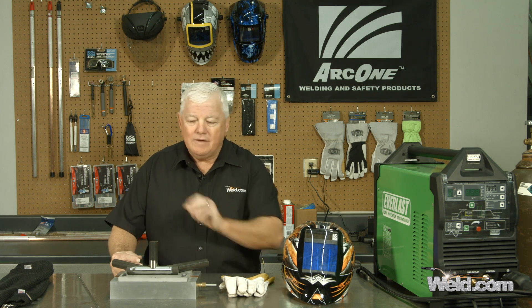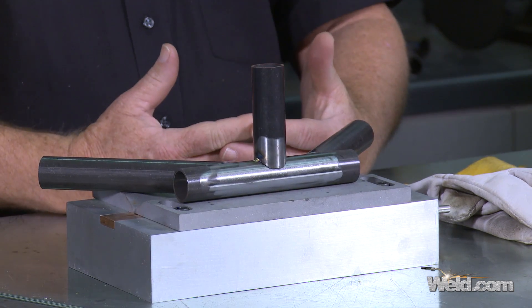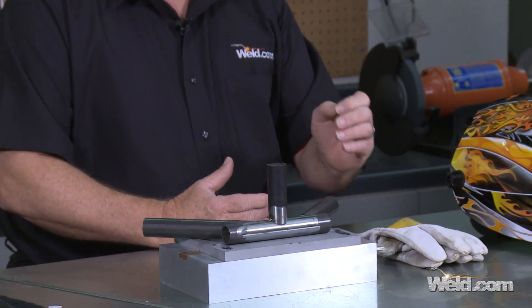So it has found its way into building racing cars, frames, and even aircraft. Let's address it and see what the good points about this filler are and what you need to be concerned about. I do have a sample set up here — this is 4130 chromoly, I have it pre-tacked, and I'm going to use this Super Missile Weld rod on it. Believe it or not, there is a generic number you can go to: it's called ER312. It is a stainless steel, and by virtue of stainless steel, you have at least 12% chromium in that filler.